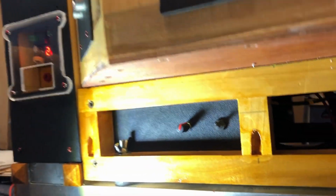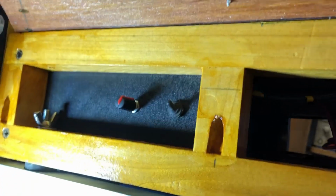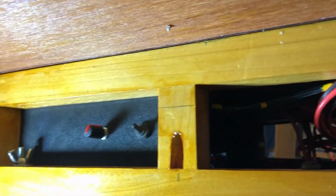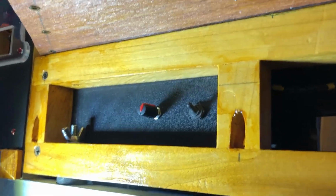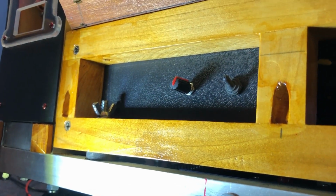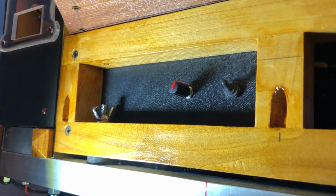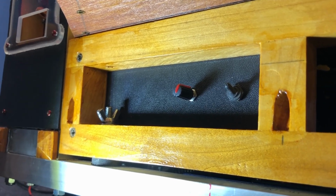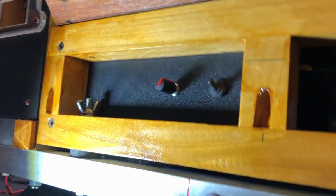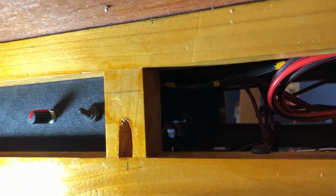Okay, this is the underside of where the computer section sits on top of the power section. You'll notice it's just basically sitting there. Now there's some dowel pins that hold the two together to keep them from sliding off and keep them in alignment. This part of the power section has a switch and a pot, and that controls the power to the blinky board, and the pot controls the speed of the sequencing on the lights.